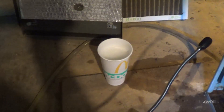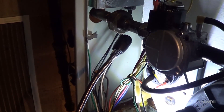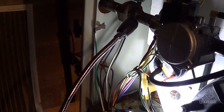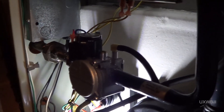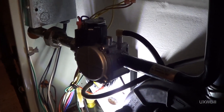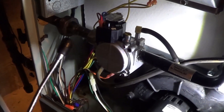I'll have to check that out. I went and looked around with the soapy bubbles and I sure couldn't find it there, but the detector was insistent that something was going on around the bottom of that union. So I went ahead and tightened everything up. I turned the gas back on — it's been about five minutes and it seems like we're probably okay now. We'll just have to keep an eye on it. I also have to do a pressure test on the outlet — the manual says it's preset, but I just want to verify that.